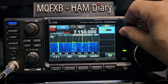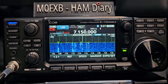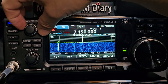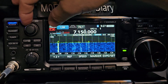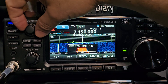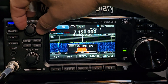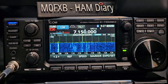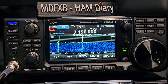If it goes to 6, it gets a bit watery, so 5. Straight away, we can hear it — we can hear that station. Just to further improve it, I'm turning the outer knob. We're on lower sideband, so I'm going to the left, and then the inner knob. Let's turn it up. Now to me, that works.